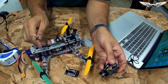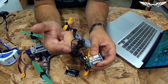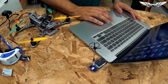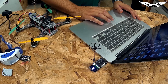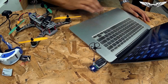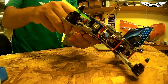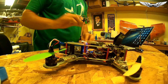I'm going to show you guys on the 5.8GHz module because I've got my white-out quadcopter here with the Immersion RC 600 milliwatt video transmitter, which is pretty popular. One thing to mention: I'm using a right-hand circular polarized antenna on my quad and a left-hand polarized antenna on my receiver — these are the new GZ left-hand polarized antennas. Normally these won't talk very well to each other, but since we're in close proximity it won't matter. I'm going to go ahead and start the capture device on my Mac. I'm also going to plug my mini quad in so we can get a valid video transmission into the receiver. Channel 5 is already set and confirmed.